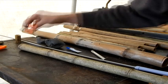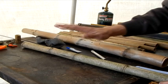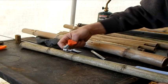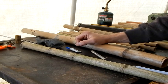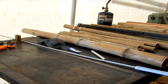You know, we have all sizes of clamps here in case we get a repair request or something of that nature. I would go back and do that, clamp it as best I can, probably put at least 2 clamps on this area, centering them on the largest parts of the crack, and let them sit there for maybe 30 minutes to an hour, and then this would be a usable piece of bamboo, if indeed we want to go that way.